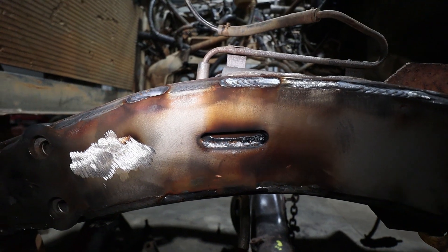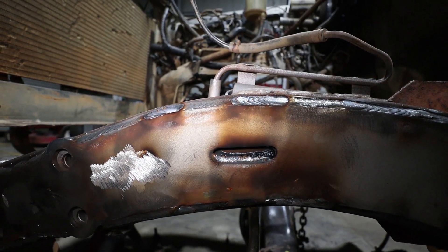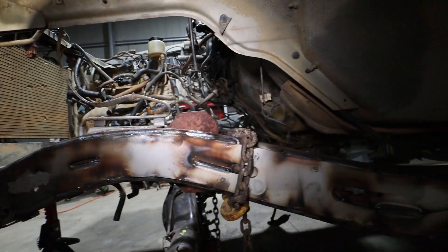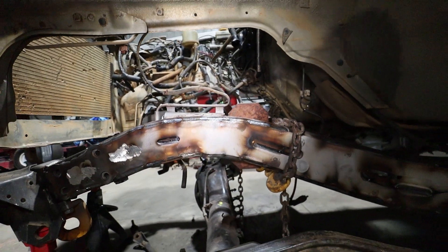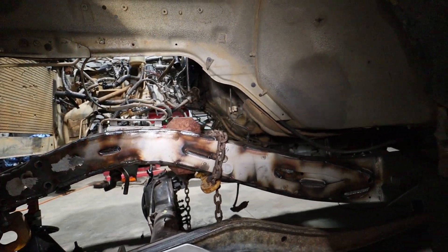You can see we've got a fair bit of porosity in that weld — that's because I've run out of gas, so this is all we can do tonight. I'm going to cut the episode here, but you can see we've actually got a fair bit done and these welds are looking pretty schmick. I had to stop to let it cool down anyway, so I think this is a good spot to cut the episode.